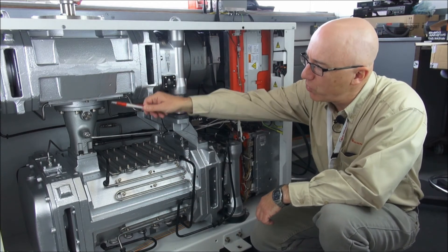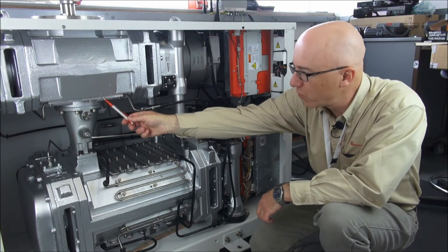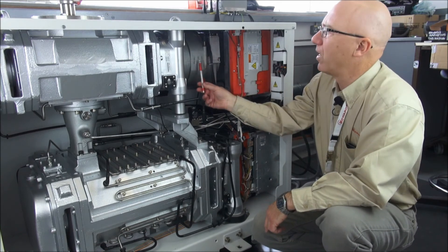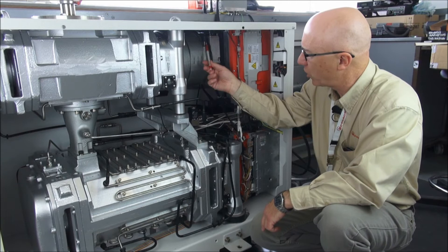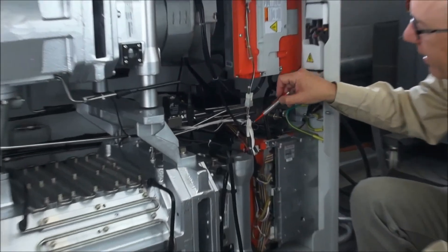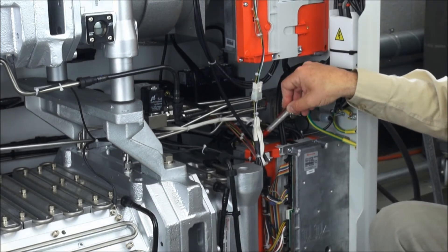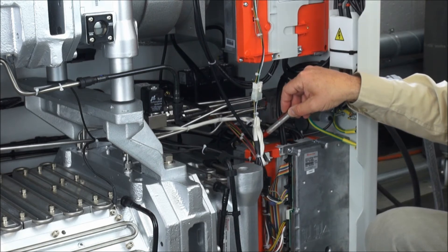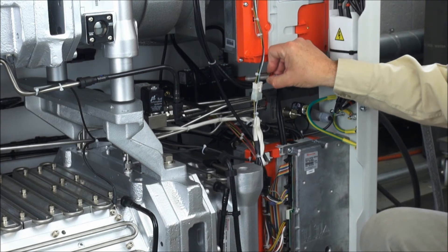The mechanical booster has cooling applied to its exhaust side and you can see the connections here. The motors have cast-in cooling coils and their connections there. The inverter has a back plate cast with water cooling coils which you can see here. All of the water cooling system is controlled with the black plastic manifold which you can see right at the back of the pump in the corner.